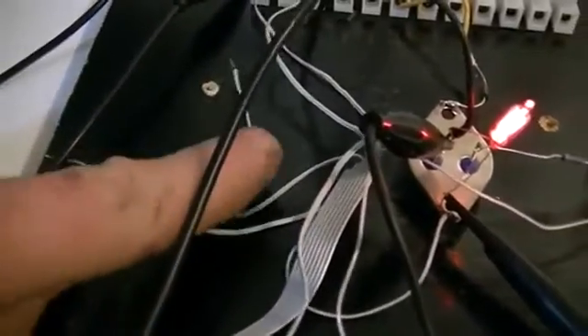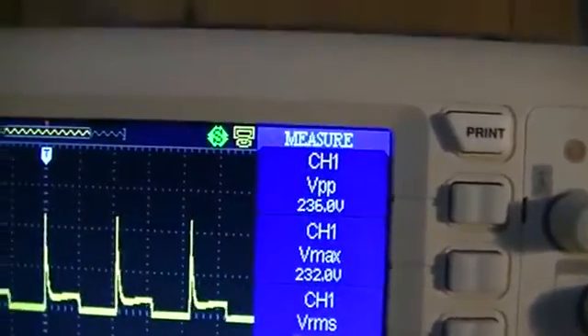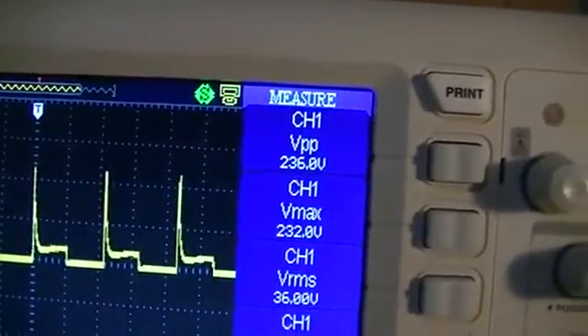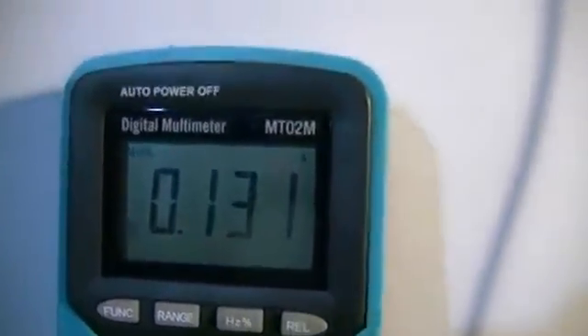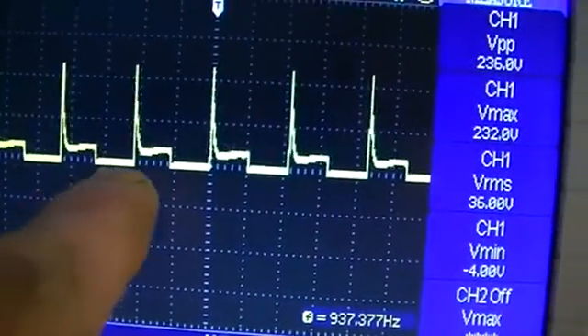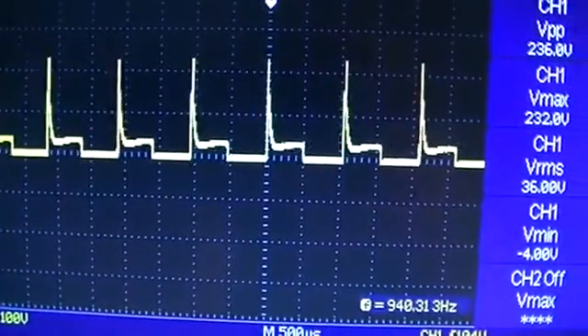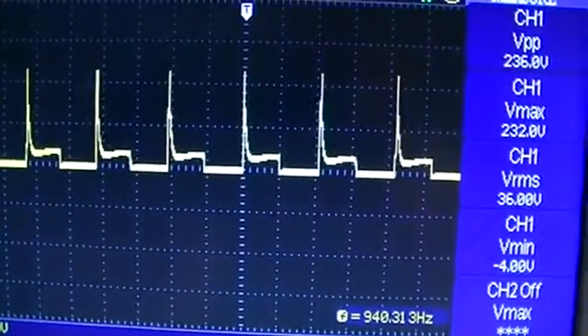The other two coils are open and used for nothing. Now the one thing about this motor is the voltage across the collector-emitter — it's very high, 236 volts peak to peak. It's fairly hungry on the current draw: 132 milliamps at about 24 volts. And the reason for that is that our on-time, which is the section of the line on the zero volts, is very close to 50%, which is why there is such a high current draw.